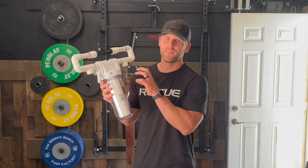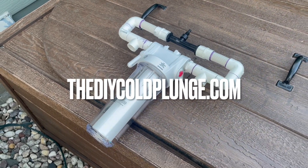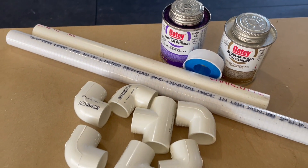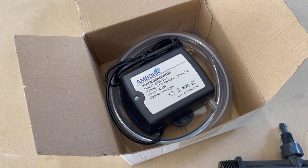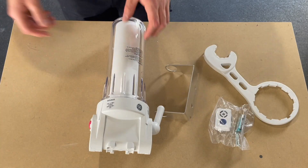This is how I built this complete filtration and sanitation system for my DIY cold plunge. Links to the exact products and fittings I used are in the description below. You'll be using three quarter inch PVC, cement, primer, and Teflon tape. The water will be sanitized by this ozone generator and venturi injector, and to filter the water, we'll be using this GE household filtration system.